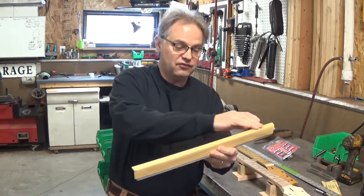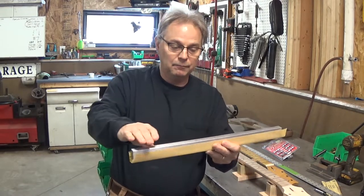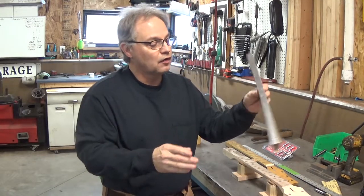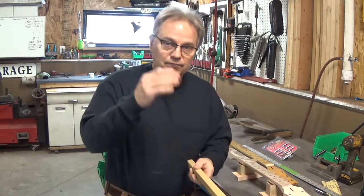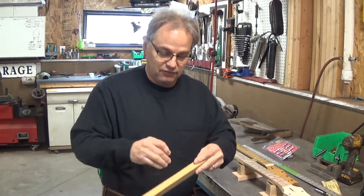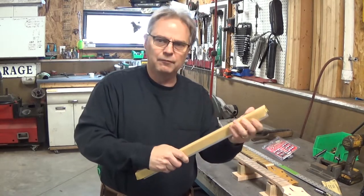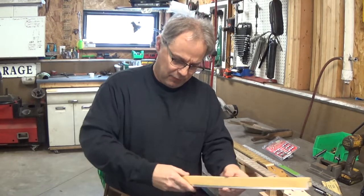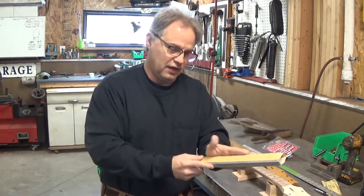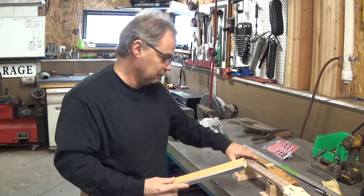Interestingly, one side is very flat and the other side has a little bit of a hump to it, so I've actually labeled it — it's getting worn off at this point. If you're going to use a bar like that and plan to use it again, make sure you label the flat side. Also, my sandpaper is pretty old, so the stick-on doesn't seem to want to stick. You want to keep an eye on that and make sure it doesn't flop off on you.